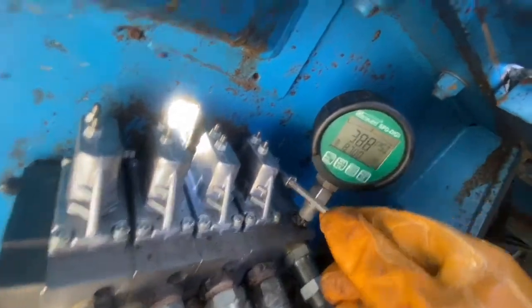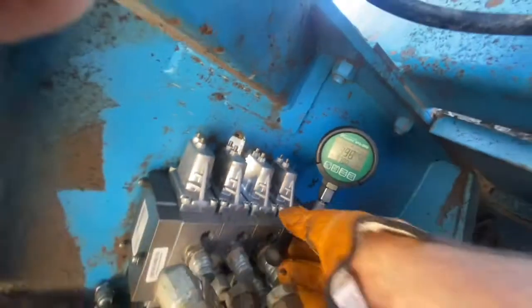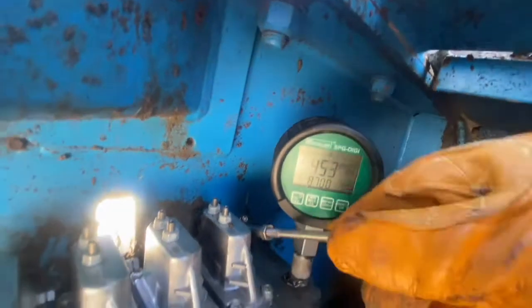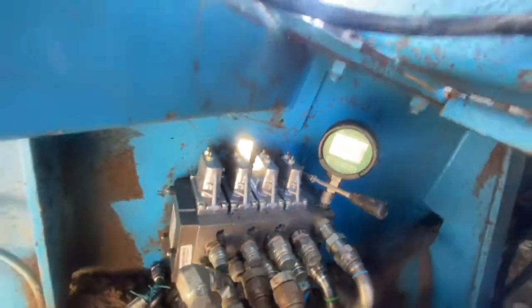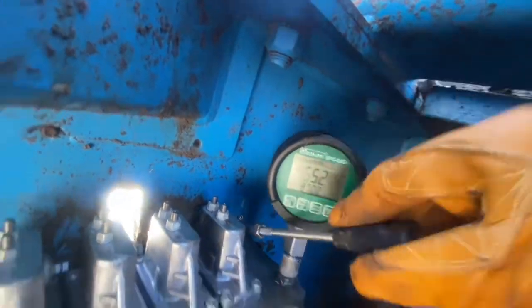Last one to do is the relief valve that sets the max pressure for the entire valve. I have not set that as high as what the schematic recommended — far from it. The reason is I'm trying to preserve the belts that run the hydraulic pump off the engine via a wedge belt. If people track the machine roughly, try to spin on the spot, or walk over things they shouldn't, you end up holding the pump over relief for a long time. At max pressure the belts have a shorter life and you have to replace them more often. If you set the pressure a bit lower the machine will walk fine — you just have to think about how you walk it. Most people don't even notice, it doesn't affect the crushing side of things, and your hydraulic pump belts will last a hell of a lot longer.